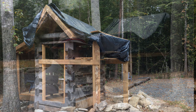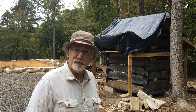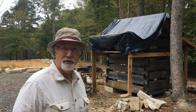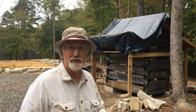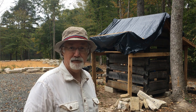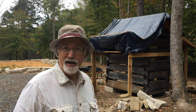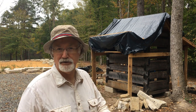When I finish up any structure at all, I try to keep it as dry as possible through the construction process until I get that final roof in place. One of the ways I do that is — as you can see behind me — just throwing a sheet of plastic up, which does the job, but it's high maintenance. It tends to blow off, it's frustrating, and it doesn't always perform as well as it could. Nonetheless, I highly recommend putting plastic over top of your roof. But today I really want to move past this plastic stage and stop worrying about whether it blows off at nighttime in a strong gust of wind.